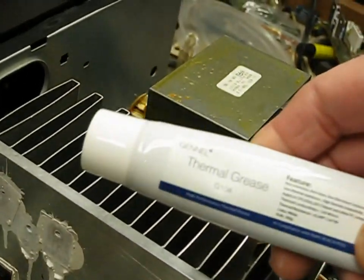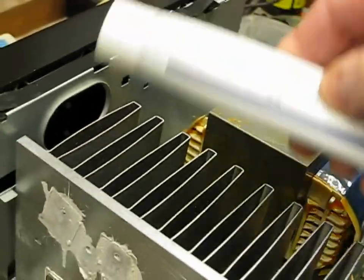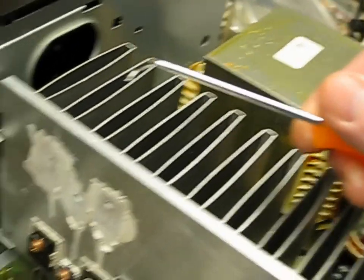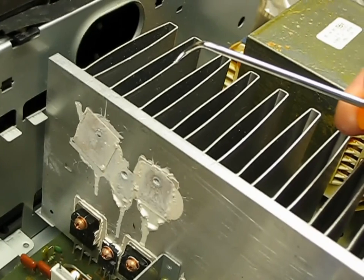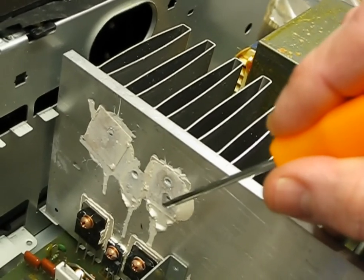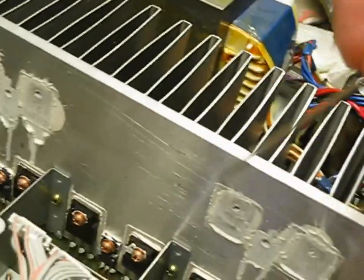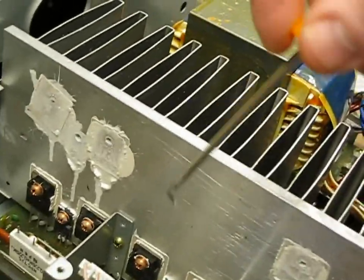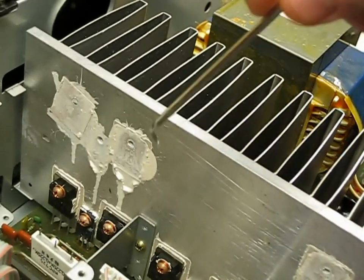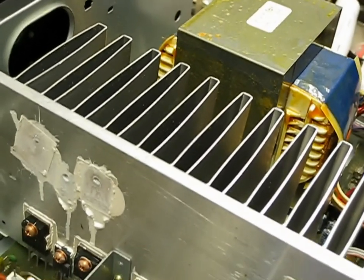So it looks like the previous repair left the insulators in place but added new grease on the transistor. I had to buy a tube of thermal paste — it's the white silicone type. You could use thermal paste for your CPU on a computer, but I don't recommend it; it's probably going to be too thick. I'm going to remove the insulators and everything, clean everything up, apply new grease with the insulators on there, then put grease on the back of the transistors and get it back together.